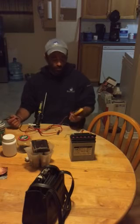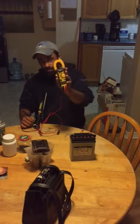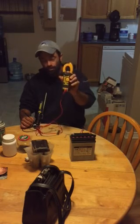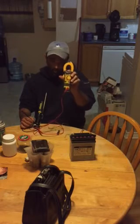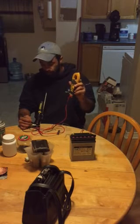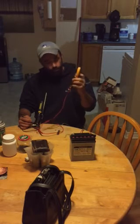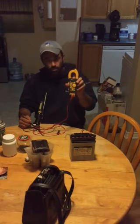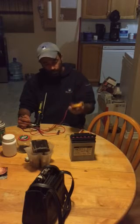So what this gives me is no resistance — or rather infinite resistance — between the plates. Nothing is picking up on the meter, and on my base or gate there's no resistance to my collector either. The device is effectively open in its resting state.